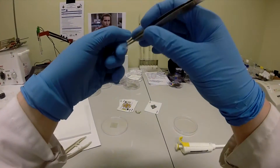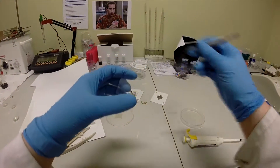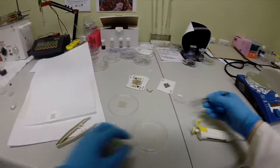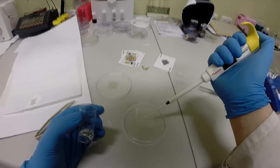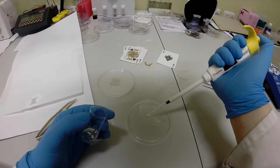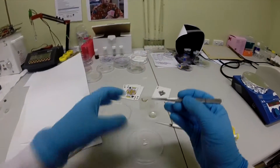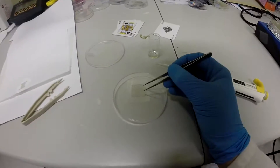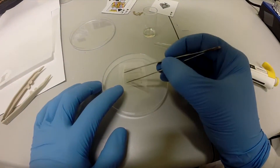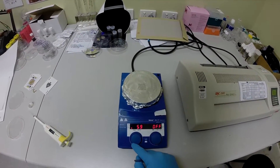Another larger PEN sheet is used for backing as a support for the electrode. Epoxy, which is a strong adhesive, is used to combine and stick together both of the PEN sheets. The PEN containing all of the deposited layers is placed face down so that the epoxy can cure and stick to all of the layers. The PEN sheet is then left to heat so that the epoxy cures and solidifies.